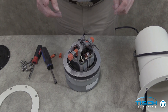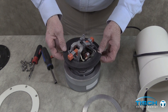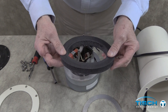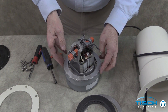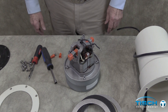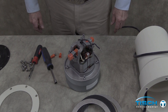Remove the aluminum spacer ring. Take off the motor cushion and inspect it for cracks and good flexibility. Replace the motor cushion with part number TE-1004 if required. Remove the second aluminum spacer ring. If using a motor other than the 110 volt VFC motor, there will only be one aluminum spacer ring.